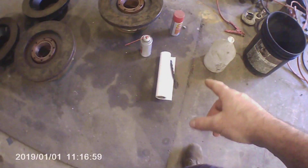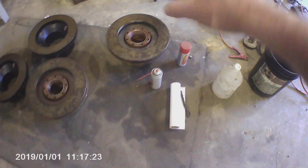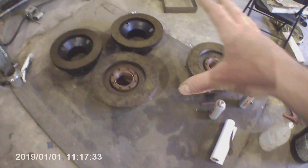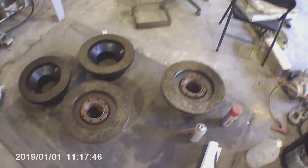What I do is double up some paper towels, make them nice and thick, and lay it on whatever I'm working on. I soak it with vinegar, scrub it lightly, and make sure the whole surface is moist — do that to all of them. Then go back to the really heavy areas with a small wire brush and just disturb it. You don't have to scrub real hard if it's just surface rust with no pitting. Let it sit overnight — make sure the surface is fully covered with a thick film of vinegar, as thick as it will be without running off.